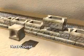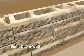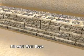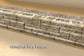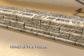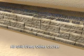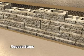Place the next course of blocks in the pattern. Sight down the wall to check for alignment. Fill with wall rock and backfill with on-site soils. Then compact on top of the blocks and behind the wall, making a minimum of two passes with a mechanical plate compactor. Then sweep the blocks clean. Add AB Reinforcement Grid on every two-course pattern or as specified on the approved plans. Then repeat these steps for any additional courses to the top of your wall.